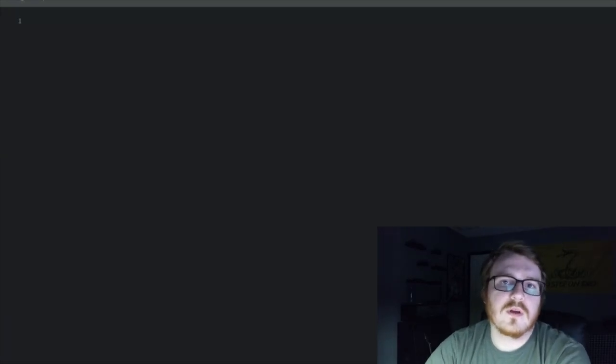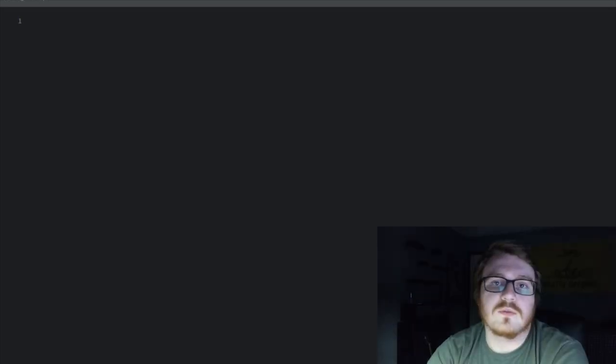So I've got the two sensor modules attached to the Raspberry Pi. So now I just need to write a script to read the data from the sensors and then make it so that WeeWX can then read it. So WeeWX has a file parse option where it can actually pull the data it needs out of a file. So this script will be written in Python, as are most all scripts written for the Raspberry Pi.